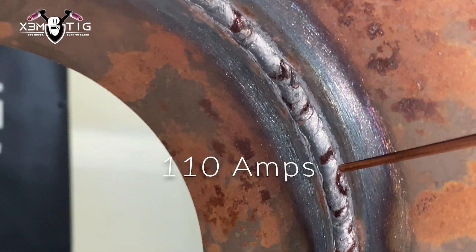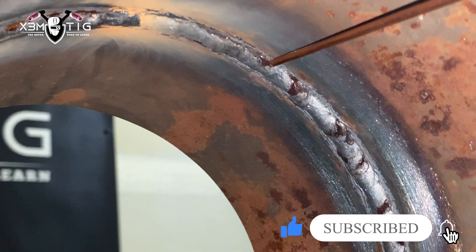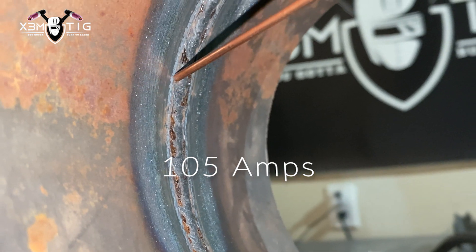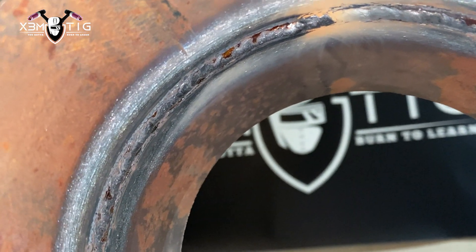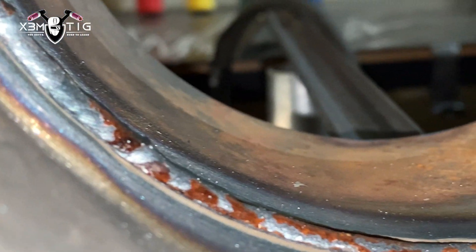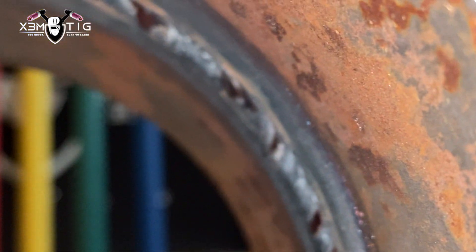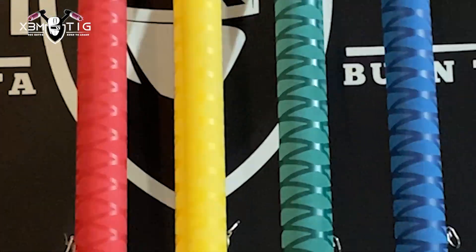This is 110 — as you can see, nothing's wrong with this profile either. You got enough meat inside; there shouldn't be any problems for suck-back, especially if you're going at 3/32 for the hot pass. And this is 105 — you can see it's absolutely different than all three others. Still a little bit profiled inside, which is also nothing wrong. It all depends on your hot pass. If you don't want a big suck-back, use a 3/32 rod and don't go too much on amps — maybe 10–20 more than what you're doing for the root pass. That's it. I hope this showed you how just a five-amp difference can have a big impact on your weld. Hope you liked it, share and like, and see you in the next one. Bye.